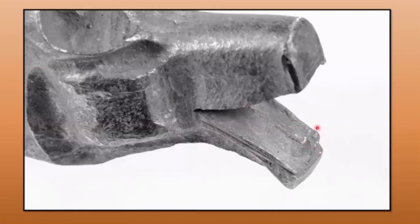I'm going to do the same here. So let's say I've gone in a 16th of an inch here on the flat, 16th of an inch on the front. I'm going to go in an eighth here. And I want you to see that that is gathering material. And that gathering of material is going to become one of the incisor teeth. So make sure that you do come in at an angle to gather that material for the incisors.